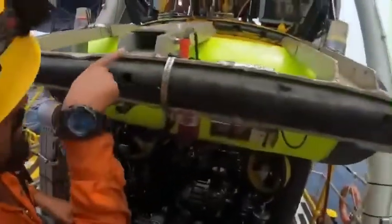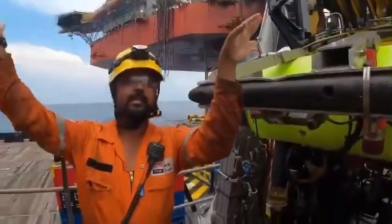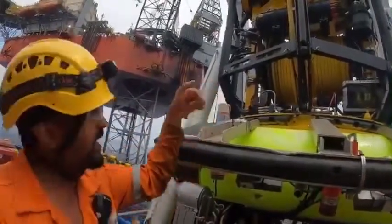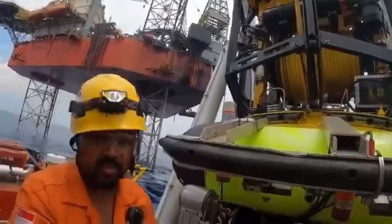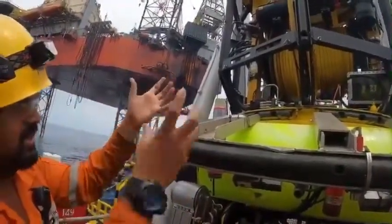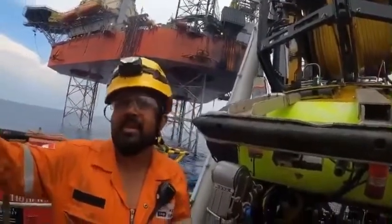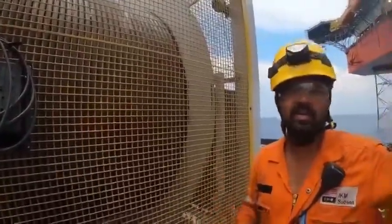Inside here there's another camera — a protected camera that looks at the back of the ROV to show what's happening there. On the Tether Management System — basically this is like an underwater winch. We have spooled in tether about 400 meters. When the ROV is at a certain depth, it will come out of the TMS and fly towards the object. We use a tether for flexibility and also for buoyancy in the water so the ROV can move around. With armored cable, which is very stiff, we wouldn't have much flexibility — that's the reason they came up with this kind of system.